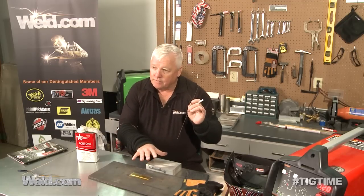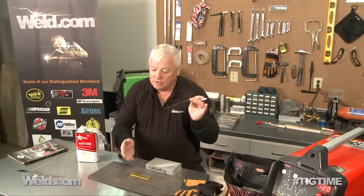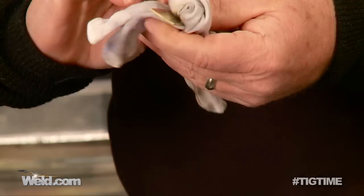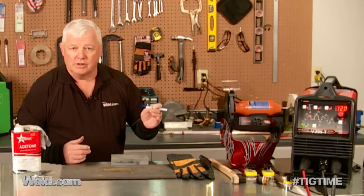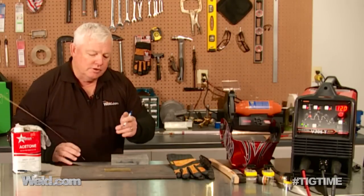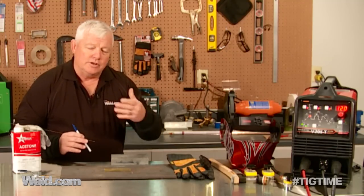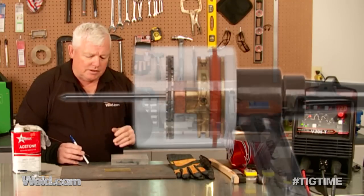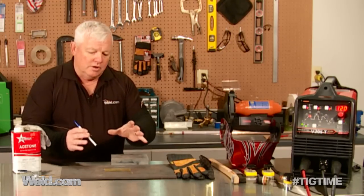We're never going to reach the melting temperature of this material. If we do, then it's going to start bubbling, and you're going to see porosity and all kinds of things. This right here melts at a little bit lower temperature than the base metal. The other thing about brass is you want to make sure you wipe it down — I use acetone as my cleaner. You can use MEK and several other solvents, but that's my preferred choice. So we're going to DC weld this with a pointed tungsten, 2% thoriated. I'm using argon at about 30 CFH, and you're going to see that I'm using the jumbo clear gas lens — I'm only using that so you can get a clear view of it. Let me get all my safety gear on, and make sure that you have good ventilation when you're welding brass.